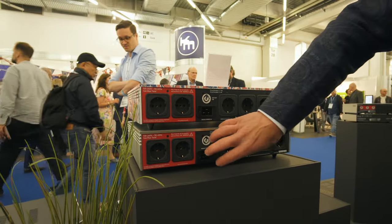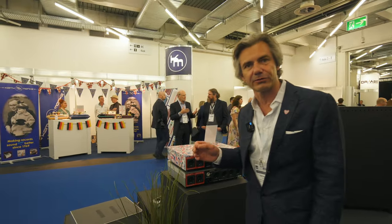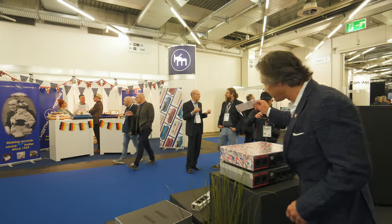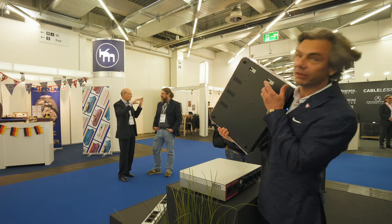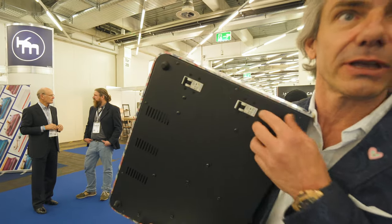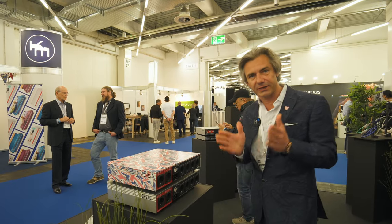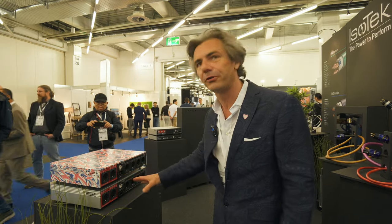The big difference between this product and the Electra is, again, 16 amps, but we actually use thermomagnetic fuses, which is way better than any kind of audio-grade little fuse. I mean, it might be gold-plated or whatever, but it's still a thin piece of wire. With our fusing system, which I can show on this, you see we have two thermomagnetic fuses. One for the high current side, one for the medium current side. And when you have these, they're 1,000 times better than any standard fuse or audio grade fuse you could get. So this is the Performance range of product.